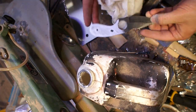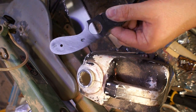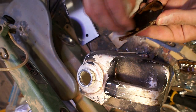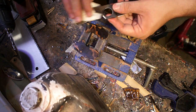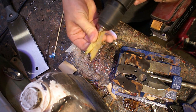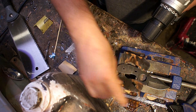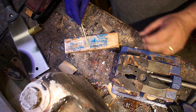It's always important to make sure everything's really clean, so I went over it with paint thinner. I also took it on the belt sander with some heavy grit just to give it a little bit of tooth and make it stick a little bit better. I'm going over the pins here — I knew you'd be able to see them through the epoxy, so I just wanted to make sure they were sanded down really well.